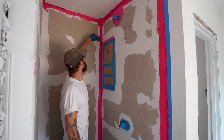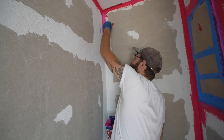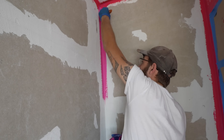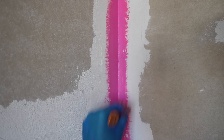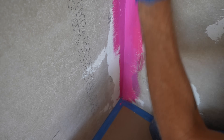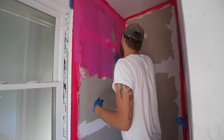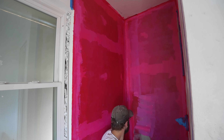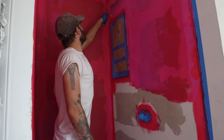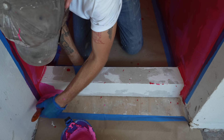Where before they had this, shower installs would basically stop at step four. One thing I've seen in other videos is people recommending applying Redguard to the corners really heavy. Now I don't disagree that you want 100% coverage and you don't want to see any spots through the red, but make sure that you don't get any runs. If you apply it too thick, it won't be able to cure properly and it'll be more prone to cracking over time — so ironically it's working against what you want. The directions call for a three-quarter-inch nap roller, which is pretty aggressive and holds quite a bit of material, but that's a good thing, especially on the first coat because it really soaks up a lot of material.